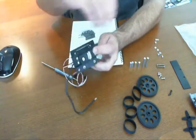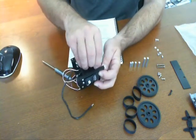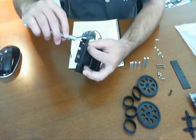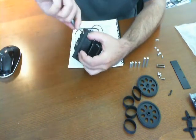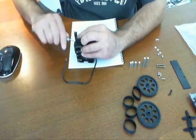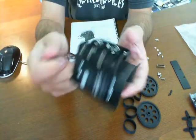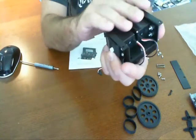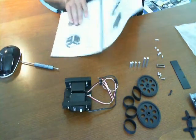The good thing is that this is a metal chassis — an aluminum chassis. They're really nice to work with, lightweight, and they usually come with everything you need already out of the box. So we're almost done here mounting these servos. A couple of tight turns to get this nice and secure. We've now successfully mounted the two servos with the battery box on top of the actual sumo chassis. Very simple. So that's step two. Let's go on to step three.